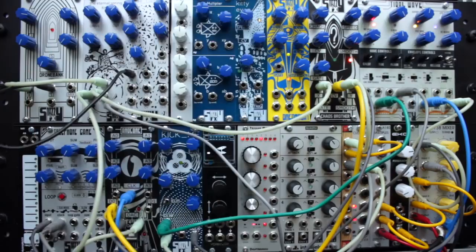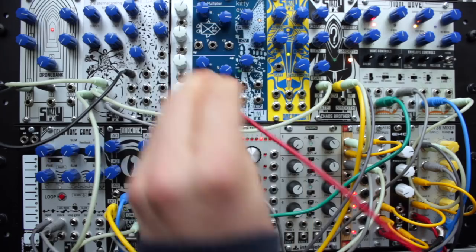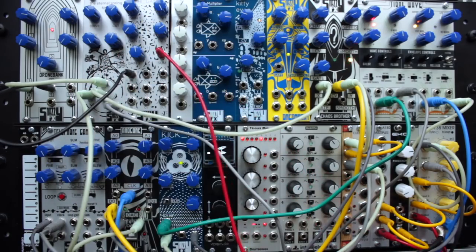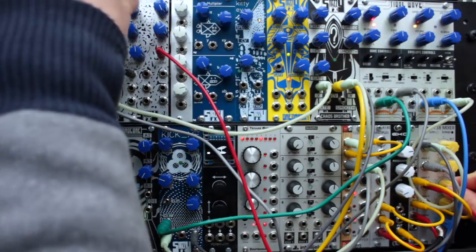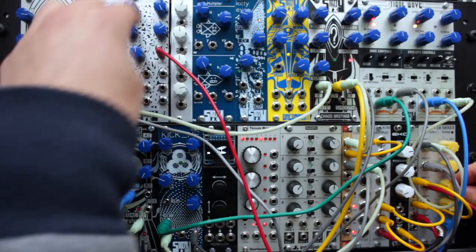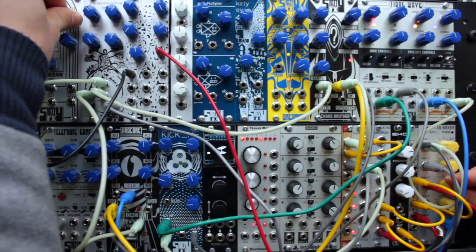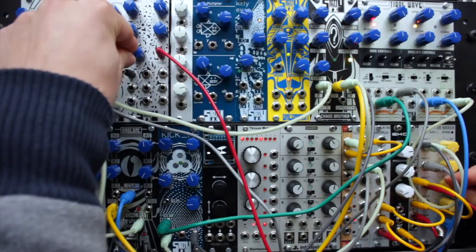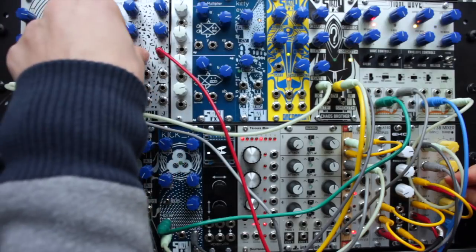This is also a wave shaping VCA, so really nothing clean here, apart from the multiplier actually. The sum output of all the 3 VCAs in here will go into my mixer then. Let's see how that sounds. Yeah, so this is actually a triangle wave originally, and this is processed by the high gain, so it's not a triangle wave anymore. We can have that actually amplified 3 times, because there's normaling going on here for all of the 3 sections.